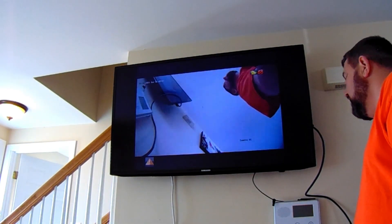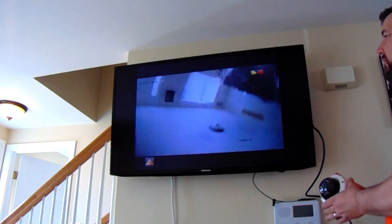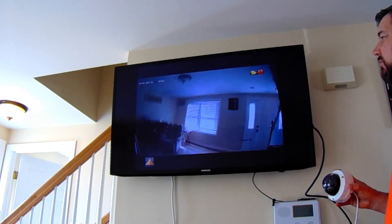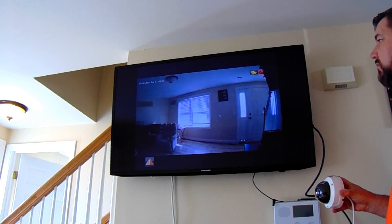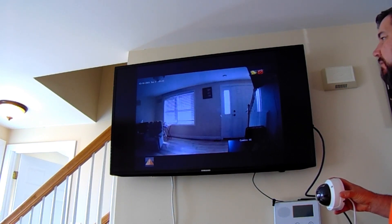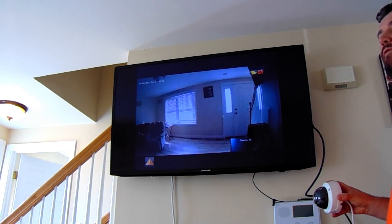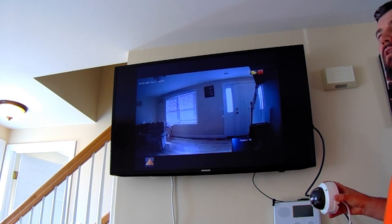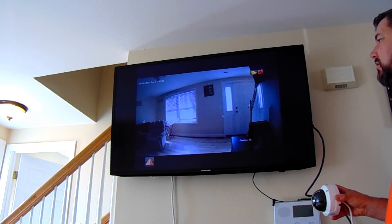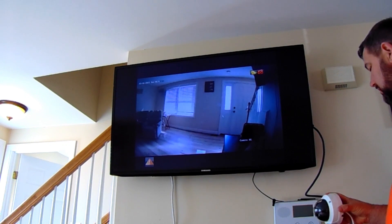And there you will see our camera. We didn't do anything special — we plugged it in, mounted it on the wall, ran the CAT6 cable to the recorder, and plugged the CAT6 cable into the PoE port in the back of the recorder. And voila — beautiful picture. This is a 2 megapixel dome, which is what you'd want for your house. If you're going to put it outside to capture license plates in your driveway, you'd probably want a 4 megapixel. But for the inside it's fine.